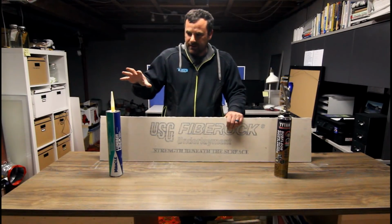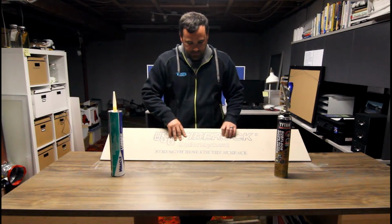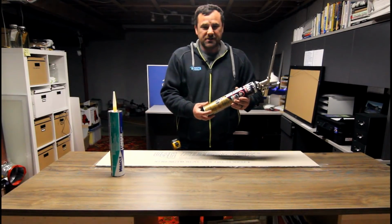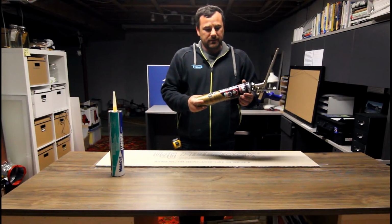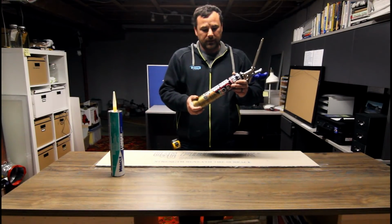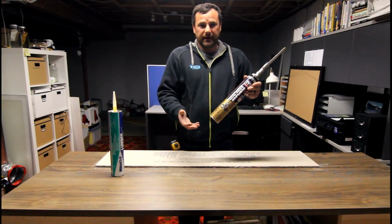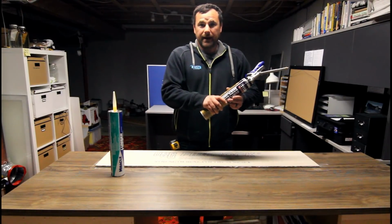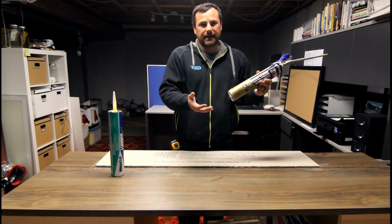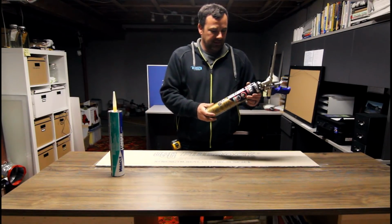Then we're just going to set all our trials up against just regular old lumber lock, right? So back to the Tytan subfloor adhesive, some advantages to it. It's a high yield can. I've actually proven it myself. You can get 10 to 12 sheets of plywood laid down on a joist system for each can. Each can is relatively inexpensive. They're metal cans, obviously, so if you leave it in the back of your truck or leave a box of it on the job site and it rains, it doesn't get damaged like this stuff would, right? This is cardboard, gets wet, blows out the side, and makes a heck of a mess.